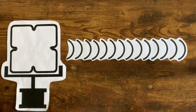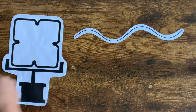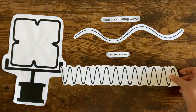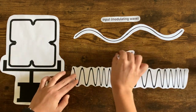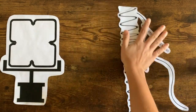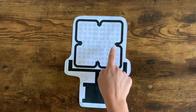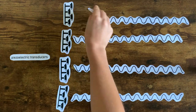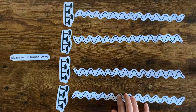How does the beam get so focused? It's a mix of properties we already understand. The audible sounds that the LRAD sends out are encoded on an ultra-high frequency wave, much like FM radio, but the frequencies used by the LRAD are not nearly as high. That allows the signal to go far. Now, to keep it from being interfered with, the outer ring of transducers are out of polarity with the ones nearer the center. This creates a bit of a barrier and allows the signal to remain very directional, as all the waves going out will effectively be canceled.